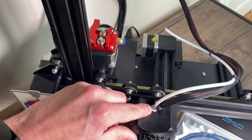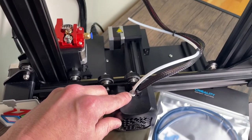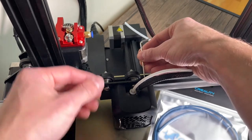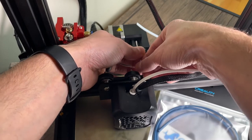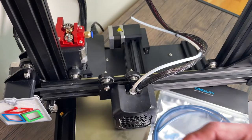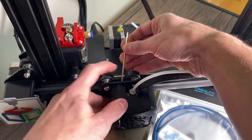In order to more easily access the fitting on the other end, I'm going to use a hex wrench that comes with the 3D printer. There are two screws on the fan cover plate here — I'm just going to take those off and that'll allow us to remove the cover so we can access the Bowden tube fitting.